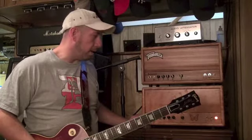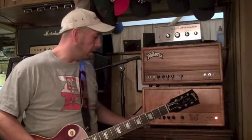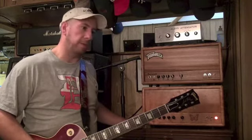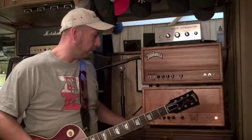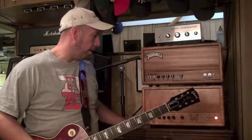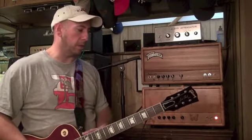Looking at a number of pictures, I've settled on trying to create the tone that the amp Ingrid has. You can hear that amplifier on the 65 Amps Lunch with Dan videos. I just love that thick bottom end — almost like it's got a fuzz in the circuit. Looking at pictures of the guts of that amplifier, there was a 2200 picofarad capacitor in parallel across the coupling cap, and I basically wired that in using a mini toggle switch, so I can put it in and out of the circuit.